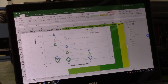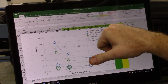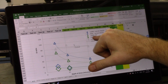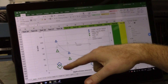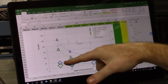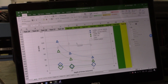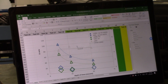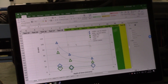We also see the effect of different grit sizes: 120 mesh aluminum oxide, 60 mesh aluminum oxide, 100 mesh silicon carbide, and 54 mesh silicon carbide. I've sized the data points relative to the actual grit size. Bigger grits allow you to true away more quickly — most people already know that. There are rules of thumb saying you want your truing grit to be at least double or triple the grit size of the diamond, and we can see those general trends in the data.